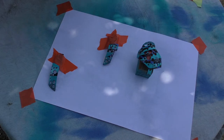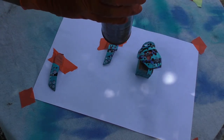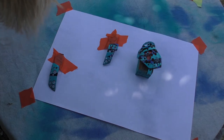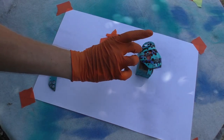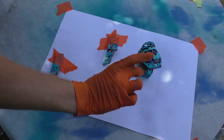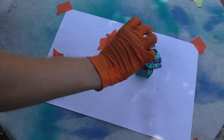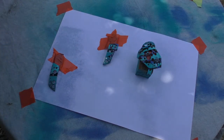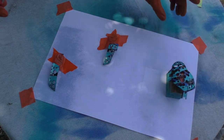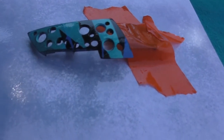This would also be easier if it was up on a wall — paint tends to spray better when holding the can vertically. Also, when your spray width is this wide and you're painting a flat surface, you don't want to start in the middle. Start a little down along the edge and then overlap from there, so you don't get too little paint along one side. After the second coat it should look nice and thick and super glossy.